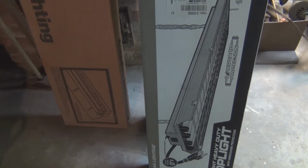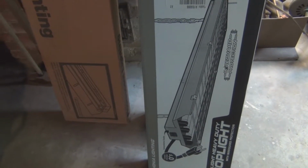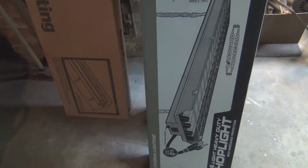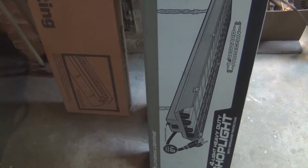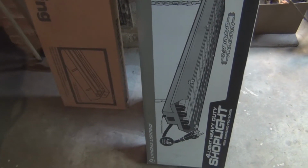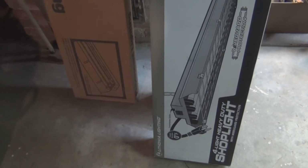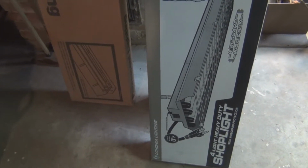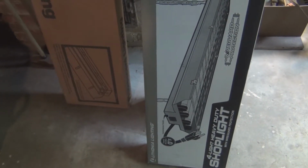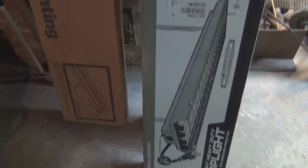With the LEDs, it's a different concept. Only one end is just a physical connection, and on the other end you have two pins. I think there's circuitry in the light itself, but you have to buy non-shunted tombstones. You have to replace the tombstones, and you have to rewire and remove the ballast that's in the fixture.